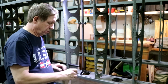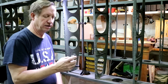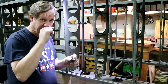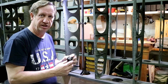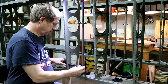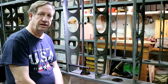One thing I did do is I pre-drilled it and put a tapered hole on it so that you can grease it. I didn't put a Zerk fitting on it — it's just more work to install the fitting and you don't really need it. A needle tip on a grease gun will easily put grease in there. It's not a tight clearance bearing, it's going to take grease just fine. So I drilled it and put a chamfer on it. I'll get it all lined up, tack it, and then weld it outside the wing.